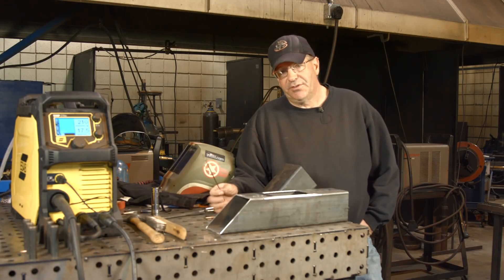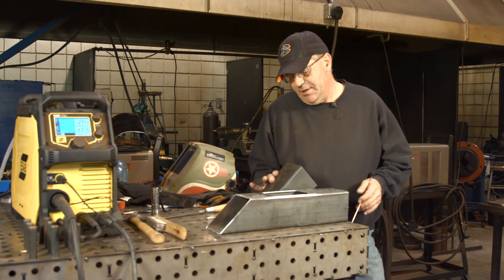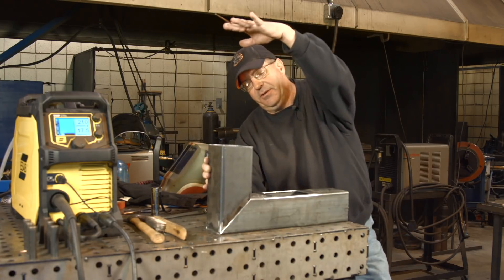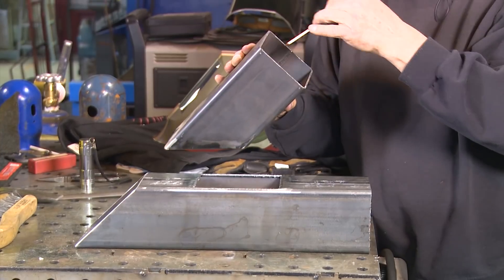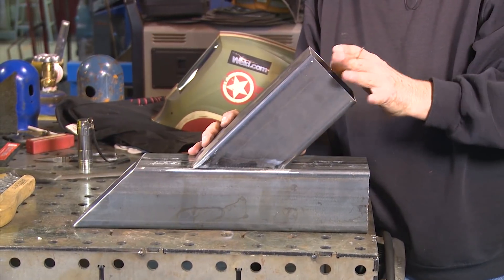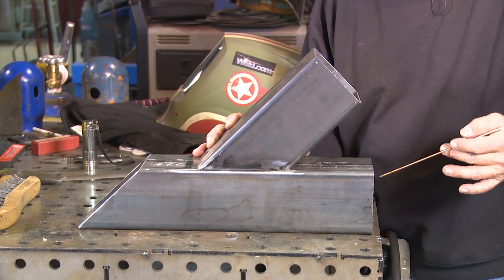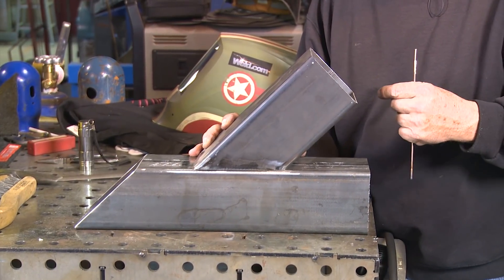This thing produces the heat. It is a near smokeless fire — it burns small kindling and chips. You can cook on it and get a lot of heat off of it. I've got a square end cut over here and a square end cut on an angled piece. The top riser would come up another 18–24 inches, with a hinged cap for feeding the fire. We regulate the air through a threaded cap piece on the other side to control airflow.